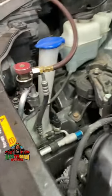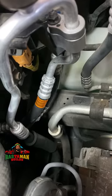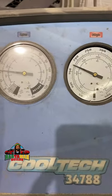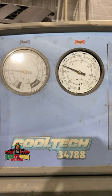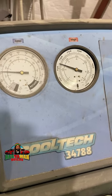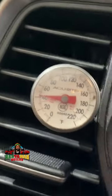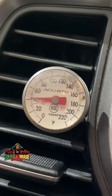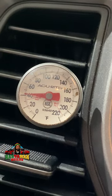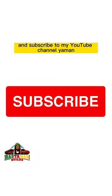This is what the finished product looks like — the lines are installed and I'm charging up the system. I have the AC machine hooked up, put the refrigerant in, and I'm monitoring the pressures to see what they look like. High side looking great, low side looking great, right where I want it to be. It's not the middle of summer so pressures are a little on the low side, but that's fine. I have my thermometer in the vent — boom, about 40 degrees! That thing is blowing bricks. Thanks for watching, have a nice day, and don't forget to subscribe to my YouTube channel.